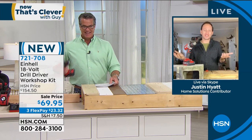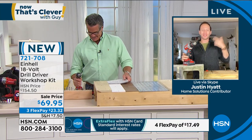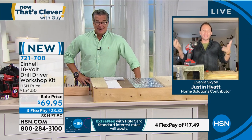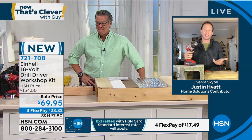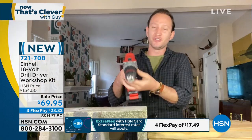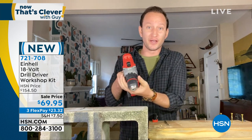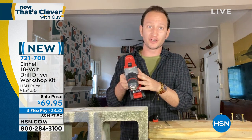It's funny because I was thinking this morning, I basically just get to show you the drill I use every single time I need a drill. Everything you see behind me was hung and built with the Einhell. It's a company that's number one in Europe for power tools, so you're getting a great name brand and a great drill. It's 18 volts and it's got all the power you need, but what's nice is you can dial back all of that power because you have the ability to change the torque. If you really have a hard job — to get through concrete — you can do it. But if you want to build furniture and not break or damage it, you can control that as well.